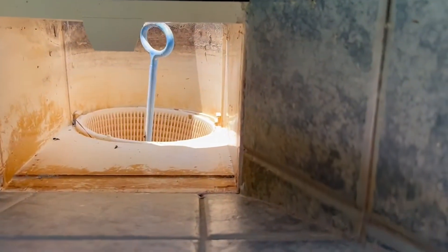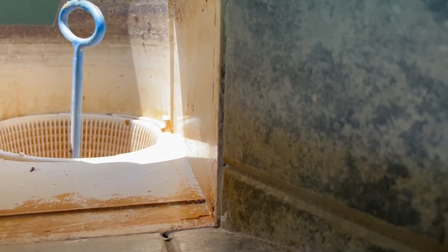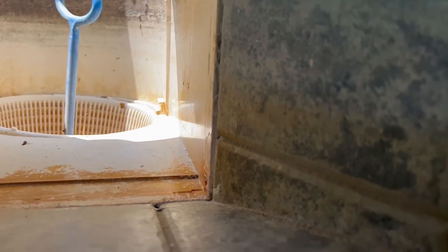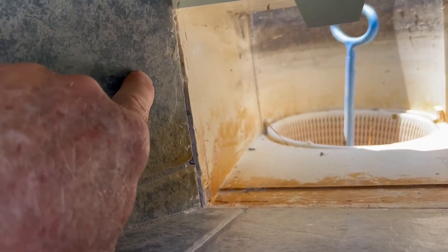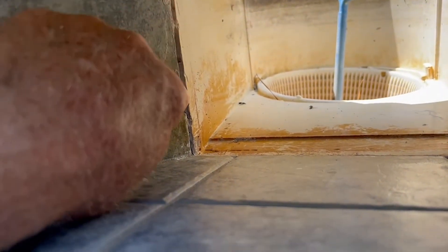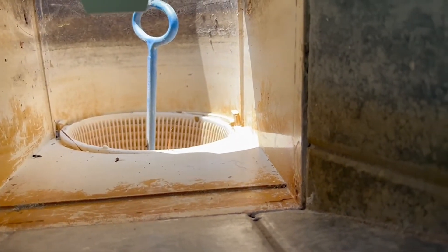Make sure that the Dremel tool and your shop vac are plugged into a GFI outlet, because God forbid you drop that Dremel tool in the water, you don't want to electrocute yourself. Now you can see that I cut a nice little groove not only into the plastic but also into the tile. It's very important that you gouge into the tile because you want good adhesion — it will stick a whole lot better where you have removed that glaze off of the tile.